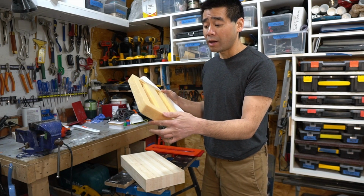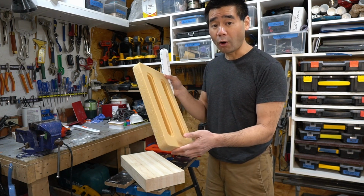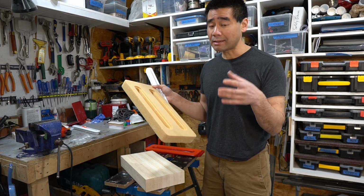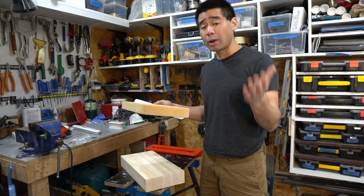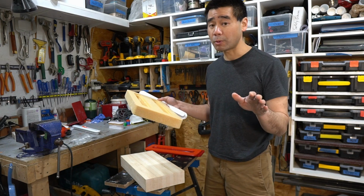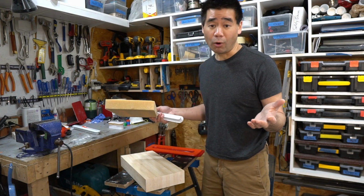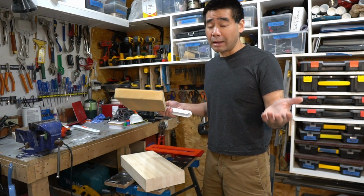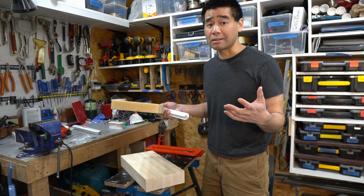So what I decided to do was, well, the recommendation and what other people have done based on my research is you make these out of polyurethane pour foam that is a greater density than like 6 pounds per cubic foot. The problem I had is I couldn't source it anywhere, at least not in the quantities that I needed. I could get it in big quantities, but I only need to make one or two of these track boxes right now, and the stuff does go bad. I did check around all the marinas and boat building places, and they all carried the 2 pounds per cubic foot, which is a very common foam, and none of them knew anything about denser foams. They tried contacting their suppliers and had no luck, which is kind of funny. You'd think for boat building that they would use denser foams. One place was able to find me a denser one, but I had to buy it in a couple gallons, some ridiculous amount, so that didn't work out.